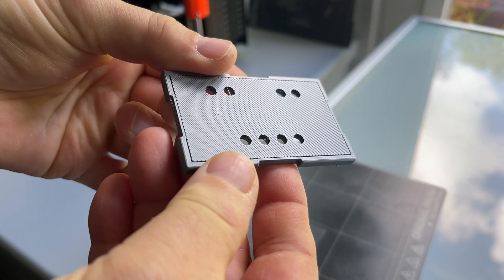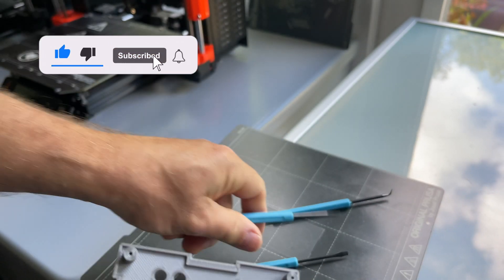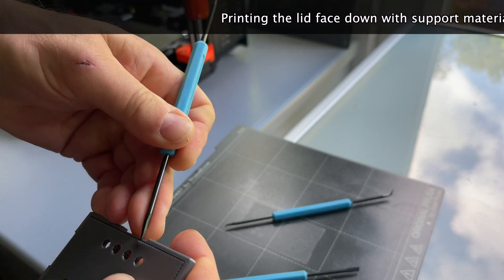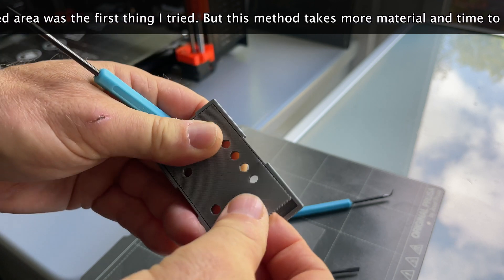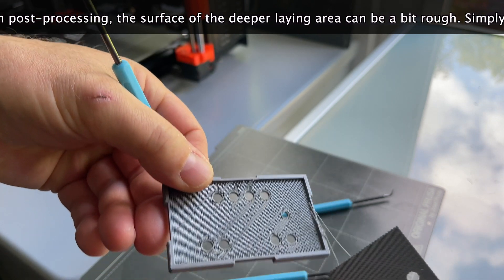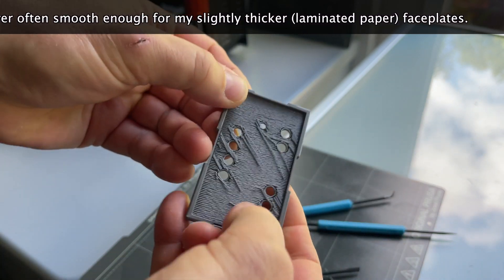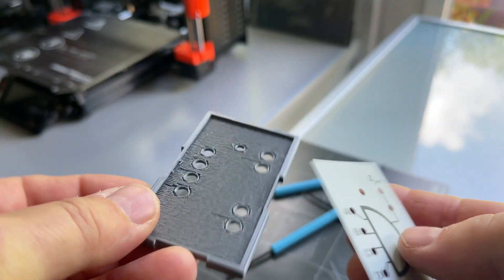Let's try to remove that support structure. I'll push through the holes to release the now redundant support material. With properly cooled PLA this is sometimes not too hard, but support structures printed with PETG can be more difficult to remove. You can see why the recessed area can't be too thin, because then it will be almost impossible to remove the support. Some strings have to be removed, but what's underneath is a fairly smooth recessed area where faceplates can be glued on later. For my laminated paper faceplates this is just fine — it's just a shame it takes longer to print with a relatively large amount of support material.